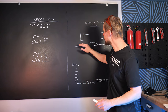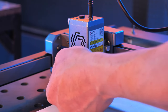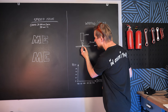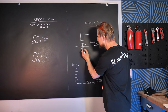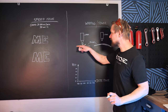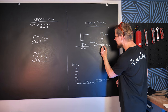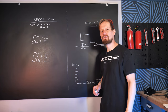The laser beam is not a single stroke — it's more like an X shape. I set the focal point on the material where you have 100% power, and further away maybe 80%. Now imagine the focal point is no longer on the material but underneath it — here 100%, and at the cutting surface maybe 80%. So you lose a lot of power. That's the first issue I ran into.